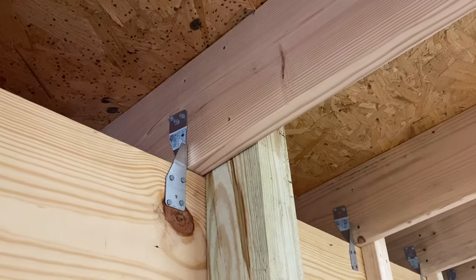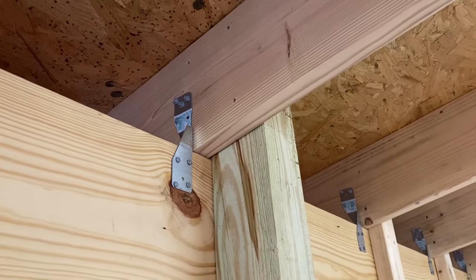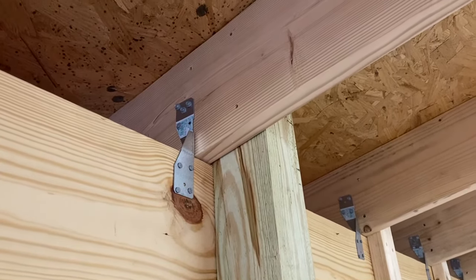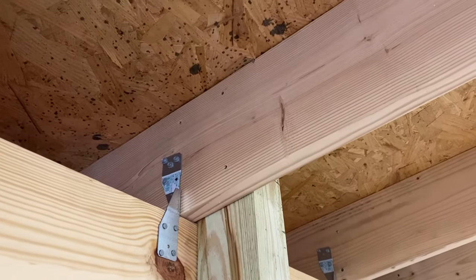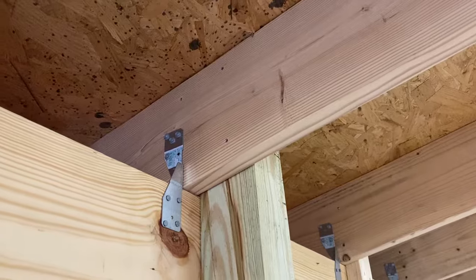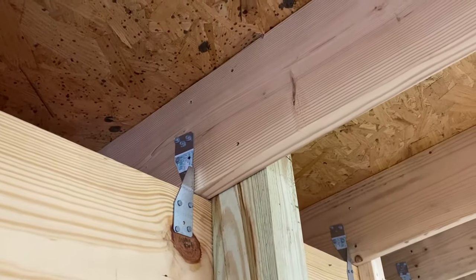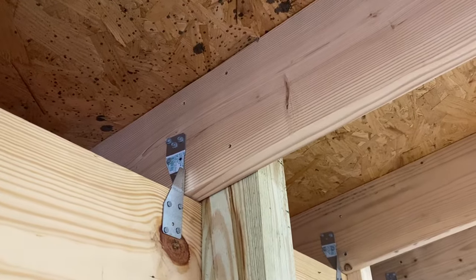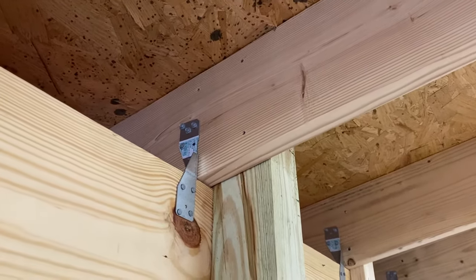you're just going to need to adjust your middle poles a few inches in one direction or another so that they line up on the side of a rafter, and then you're able to nail that rafter into the pole. And that's just a great way to do it. It gives you so many benefits. So it's very important, if you can do that, do it.